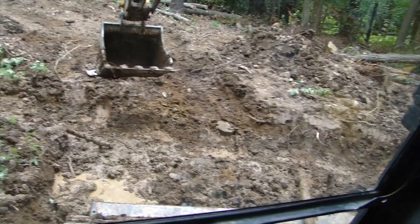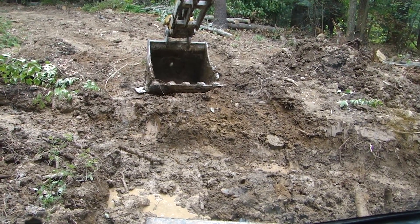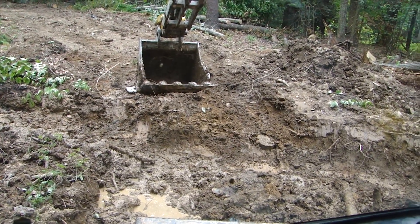Now I'm going to put some gravel down. I got some half-inch to one-inch crushed with fines that I'm going to put in there. That'll compact really nicely so it won't allow drainage to go through the gravel, but it will prevent the culvert from sinking. We want all that drainage to go through the culvert, so I'm going to go grab some gravel and dump it in the trench.